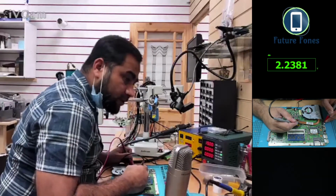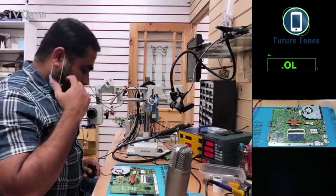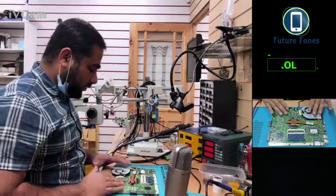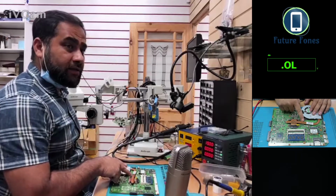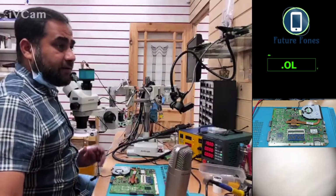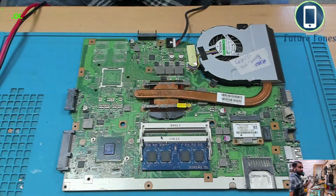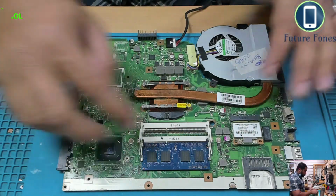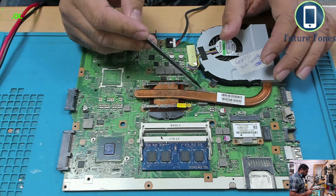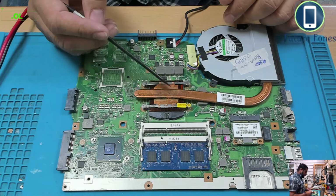So there is some resistance, which is okay. That means our CPU is not all dead yet. We have power coming through everywhere, only we do not have power in the graphics area. We have power everywhere except for these two coils, and these two coils are for the graphics, and they are connected to this big IC here, which is the CPU